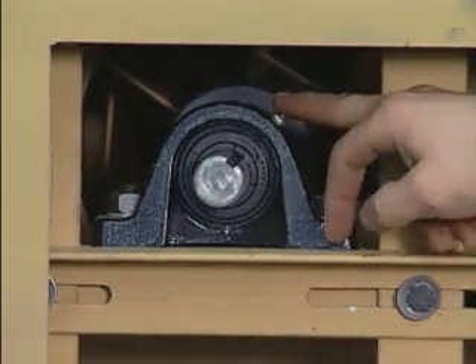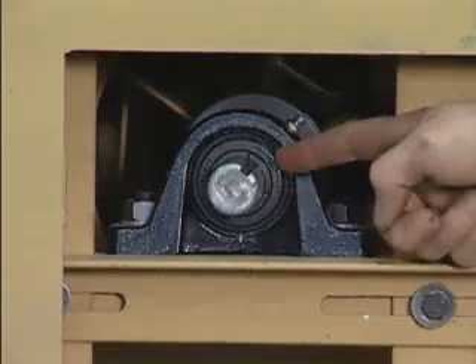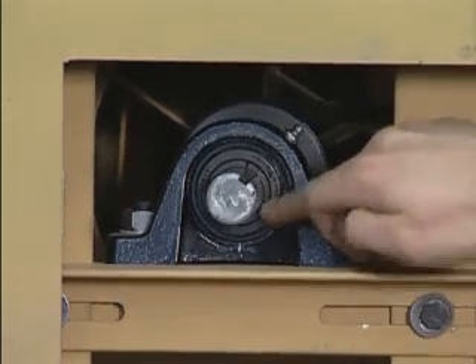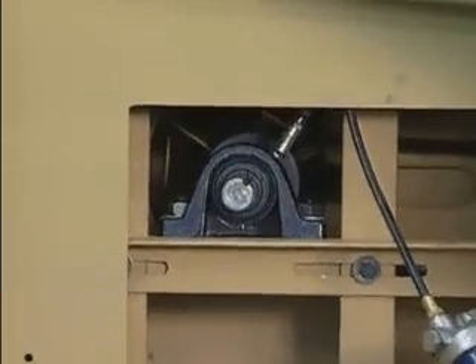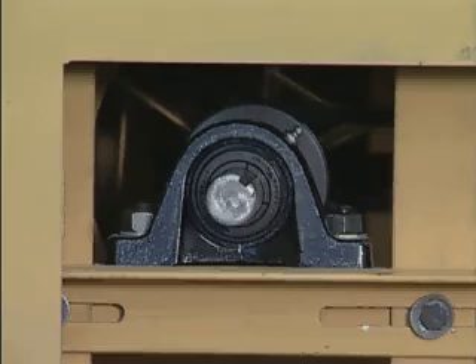We supply top-quality U.S.-made sealed bearings that provide a positive lock to the shaft. All bearings are installed using Loctite compound and are fully tested for rumble and overheating. The most common problem on new equipment is shaft-to-bearing contact failure. A bearing set screw comes loose and allows the bearing to turn on the shaft, wearing a groove in the shaft. Check all bearing set screws after your machine has run 8 to 10 hours and again after 150 hours of service. Even sealed bearings require occasional greasing. Don't over-grease bearings — only one shot of grease every 1,000 to 1,500 hours. It is always a good idea to thoroughly check the bearing set screw, bearing housing, and the adjoining shaft while greasing.